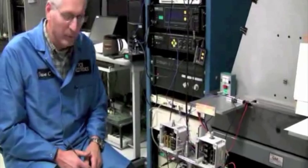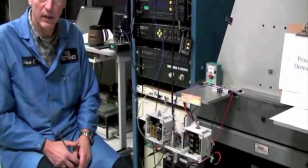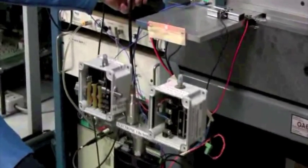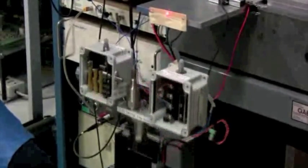So let's continue on up and see if at this frequency a pure unbalanced condition could get high enough to trip the switch. You can see the linear adjust switch did trip, but we still haven't tripped the traditional switch. So I'll move it up some more. And again, we don't have enough vibration there. Oh, finally we tripped it when we started hitting.